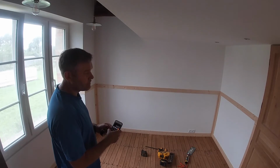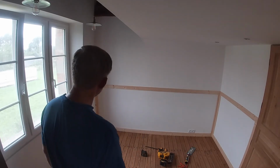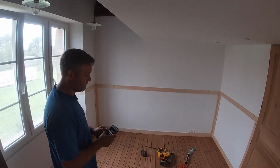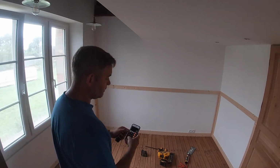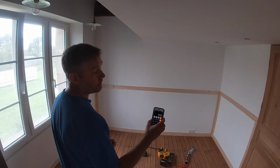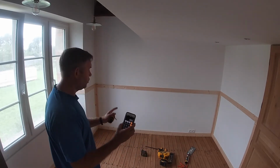So obviously we can't have 4.5 unless you have 2 half panels either side, and that's just going to look ridiculous because they'll be tiny. So what we do is we take the nearest full number, so we could do 5. So 2775 divided by 5 gives you a panel width of 555 for each panel, and they'll all be the same